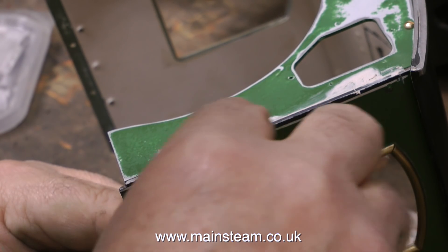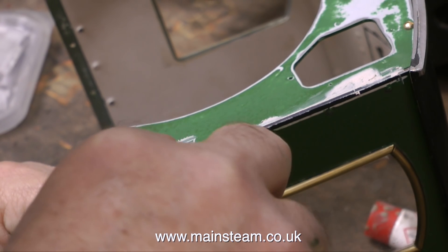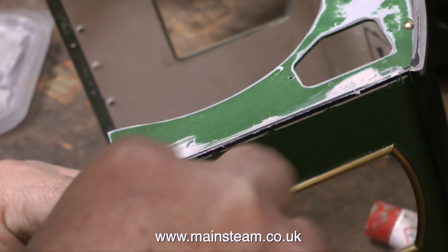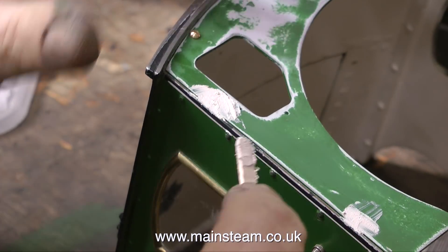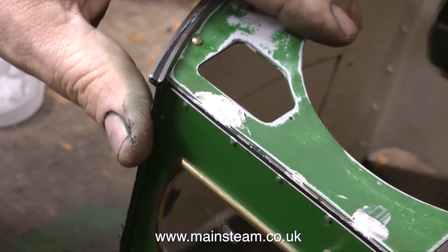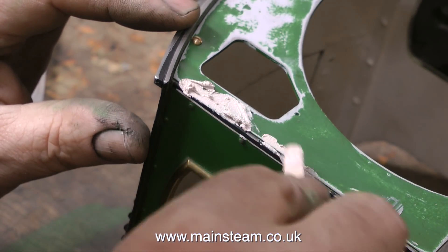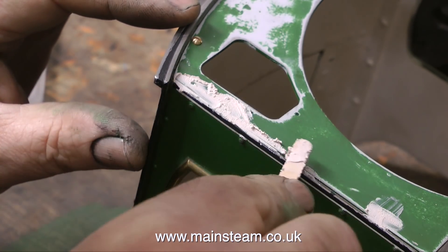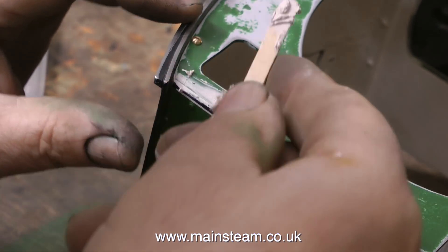In this clip I'm filling the heads of the countersunk bolts. The original four countersunk bolts were also filled like this, but the original bolts got damaged as I removed them, so I fitted some new ones — they are 8BA countersunk bolts, or machine screws. There's a bit of a debate on this, but they are not self-tappers. They have a proper thread capable of taking a nut, but in this case the metal is threaded and the countersunk bolts screw into that.